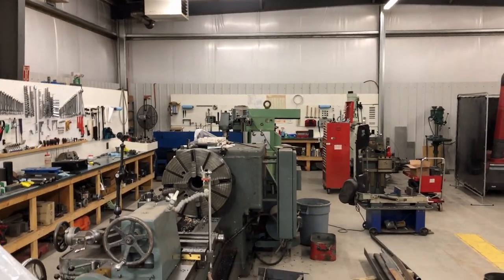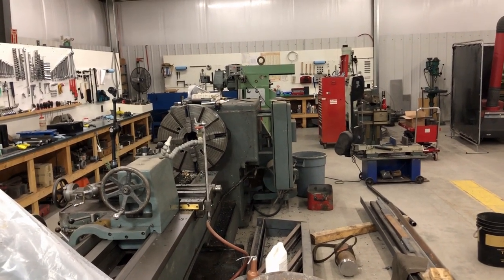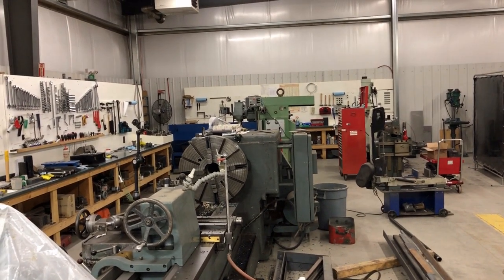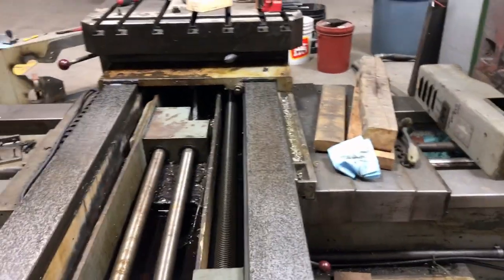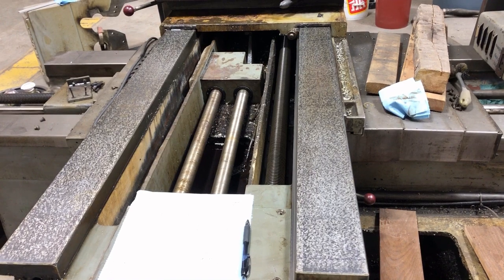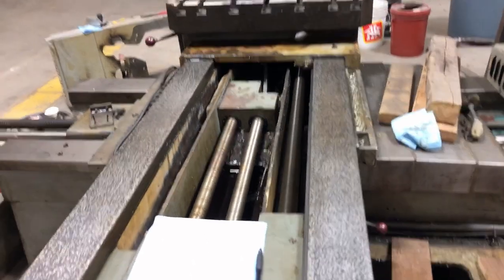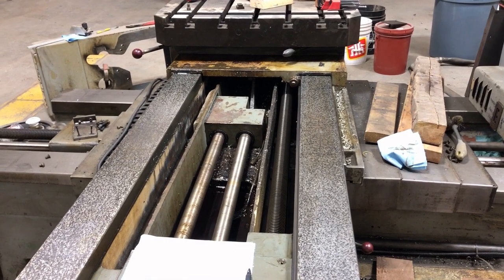On my horizontal milling machine - my green one - over about a three-foot length, I get a variation in thickness when I do that of about three to four thou, so I know the travel is one and a half to two thou out of straight. This one, we'll have to see - I think it may be better than that. If you'd like, leave a comment. I'll post a picture of my chart with all my measurements at the end of the video if anybody cares to look at it. Thanks for watching, and we'll see you in the next video.